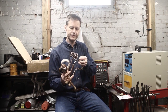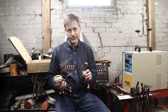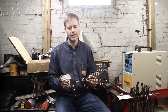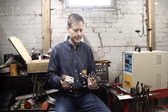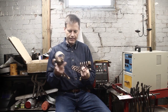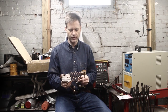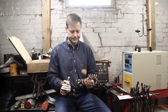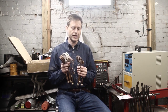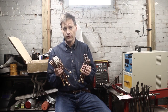I've altered the number of loops based on size. You can use about 200–600mm — that's up to about two feet of coiling copper. Get too much more and, depending on what size stock you put in it and how hot the steel is, your induction heater may not be able to drive it. These are all useful for different sizes. I've got another video on why you want a good match between the size you're working with and the diameter of the coil.